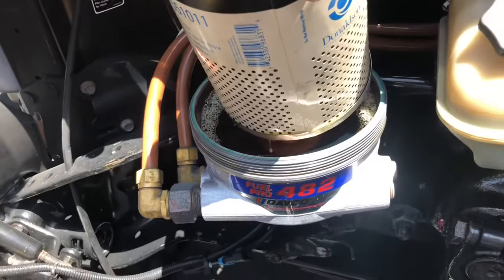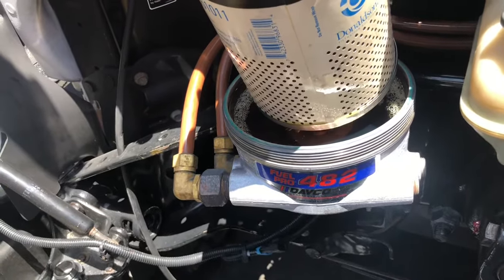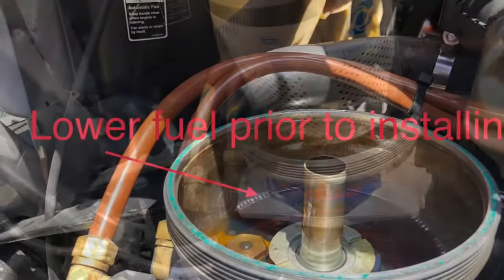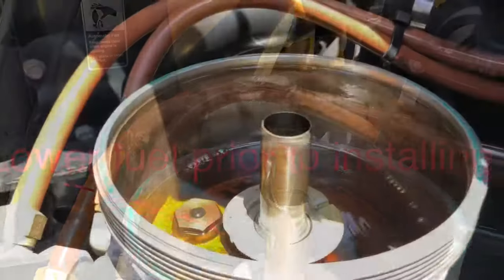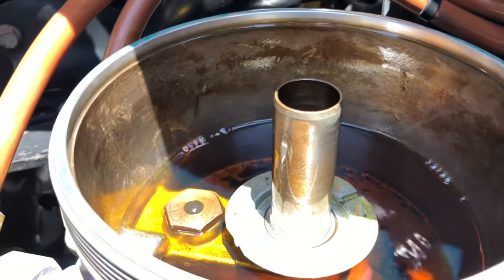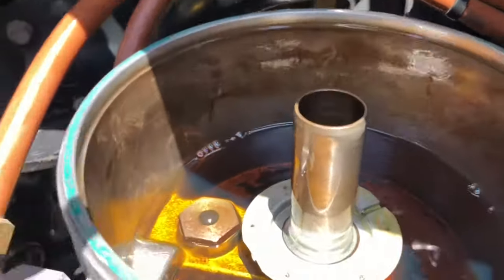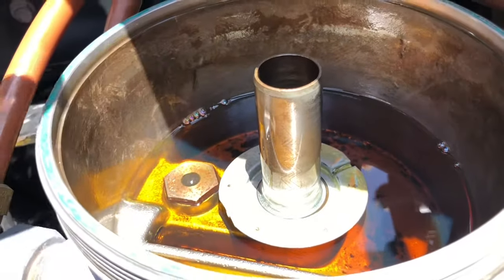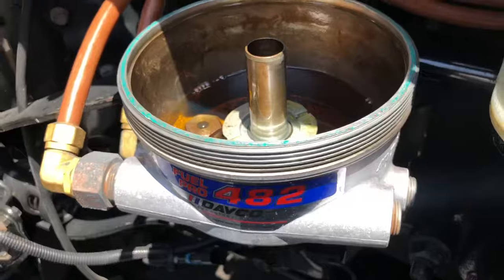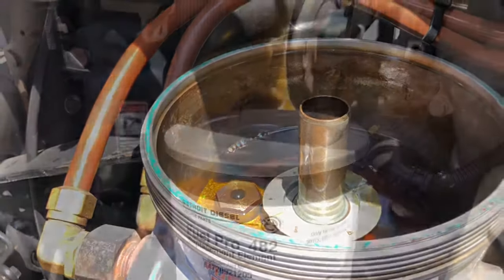There you go. Let's get that cleaned up. We're going to prepare our new filter. This is typically how far I'd like to drain the diesel before I install a new filter. And what I'd like to do is simply just clean the edges, clean the outside of the bowl. This will help you so that when you install your new filter, you're not going to get a big splash of diesel spilling everywhere. Drain it, clean it, and you can install it.